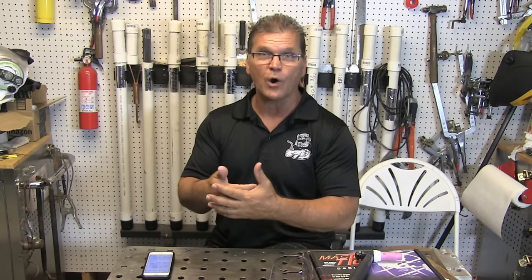Who is this guy? I like him. Now if you're doing coded work, stringent applications, critical work — you need to use the certified die check liquid penetrant stuff. But just for a quick look like what I did on this part, to identify where the end of a crack was and make sure you get it all out, I'd say give it a shot.